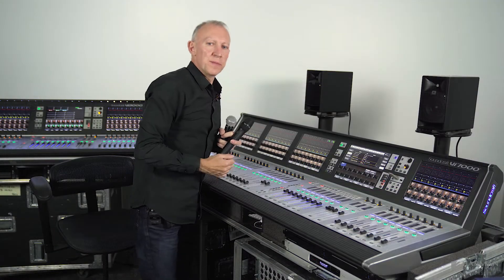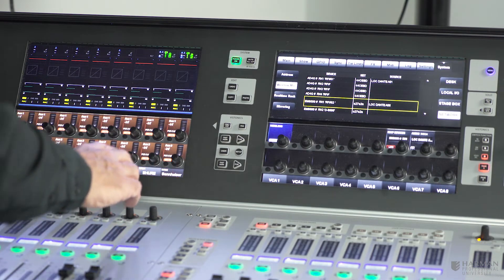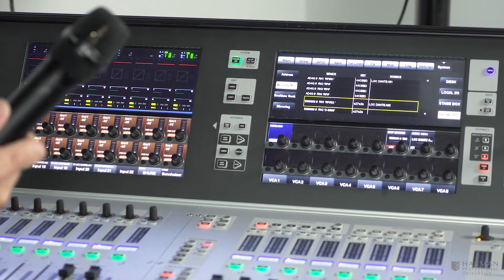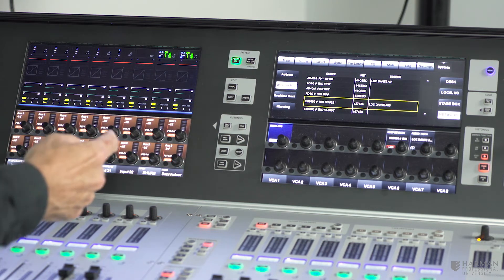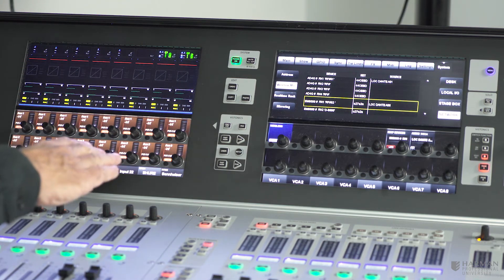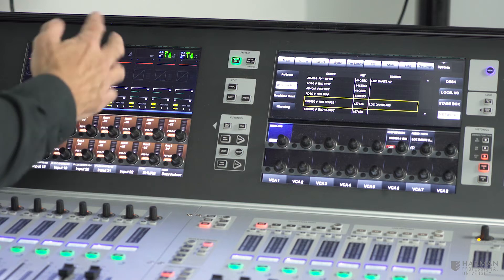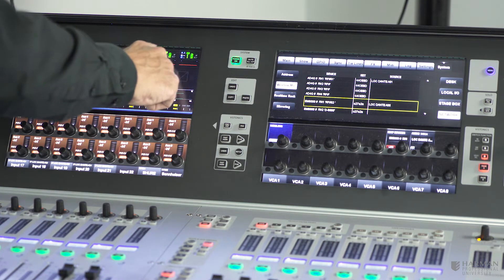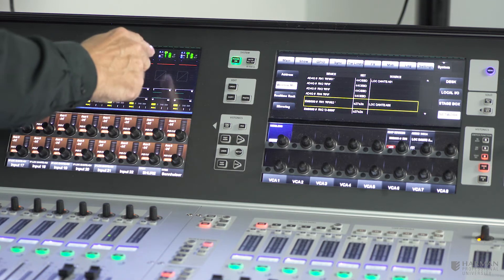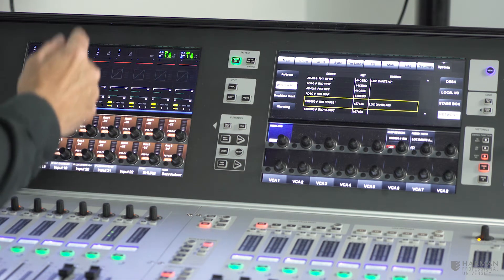Now when we go over to our channel strips where the audio from these two mics is, and look at the top of the input strip, we can see icons showing the status information for our two mic transmitters. There are battery level indicators that change color from green to amber to red as the remaining time drops — at the moment we've got full batteries on both the Shure and the Sennheiser. We've also got an RF good/bad indicator in green, a meter showing signal integrity, and an audio level meter with a clip indication showing clipping within the wireless channel.